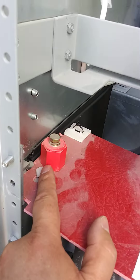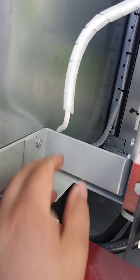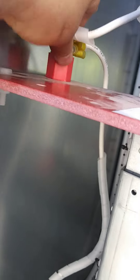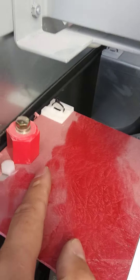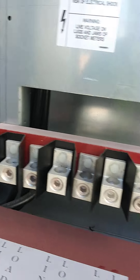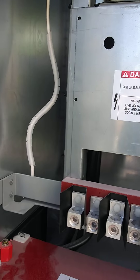We're also going to cut this one and land it here, then just add a jumper from here to here because this one is not long enough — we can't make it work. So we're going to have to splice it right here regardless. When we cut it here, we'll add another piece from here to this one right here, and then land of course this one that's already terminated on the bus bar. That way these guys don't have as hard a time as we're having right now.